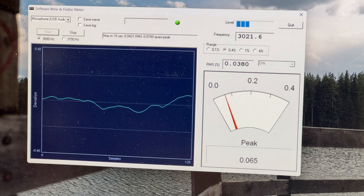So let me see if I can work this loose. I'll stand that cap up. I'll just gently pry this one up. This one's getting replaced anyway. Which reminds me, I need to do that to the top so I can tell which one it is. Because the reason I'm doing this is because if what I'm doing in the recapping breaks the auto calibration, I want to be able to one by one put the old caps back in and see which one clears up the issue so I can match a new part to the old one better. But I don't think I'll have any problems, but you never know.